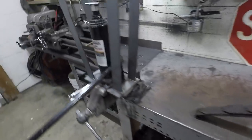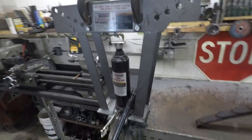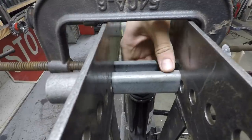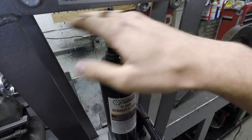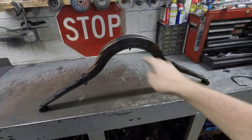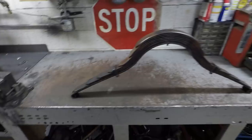What I have here for my setup is a pipe bender from Harbor Freight that I have modified. I've got these pins across from there with some pieces of steel just to have a flat spot on the bottom. I made this little tool to go on top of the ramp here. I'm going to put the spring in between there and just kind of work it into shape, and hopefully get it completely reversed so that the spring eyelets would be on top instead of on the bottom.